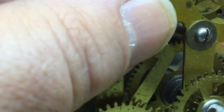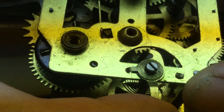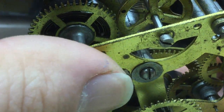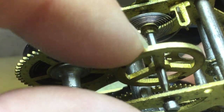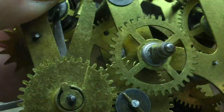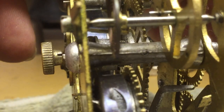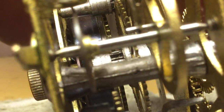If you're a really meticulous type of person and you wanted to adjust the clock to keep perfect time with the regulator in the exact middle position, this is how you would do it: figure out where the end of the hairspring needs to be, then adjust the collet on the arbor to get the beat set. It looks like it's pretty close to being in beat — the impulse pin is pointing directly at the escapement arbor.